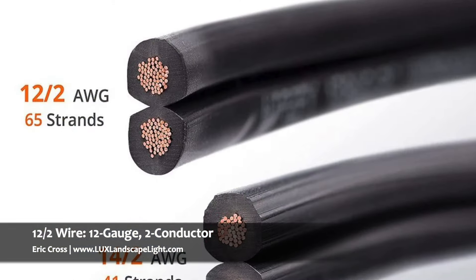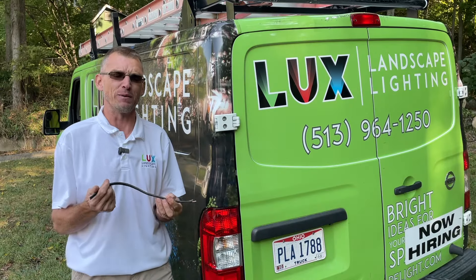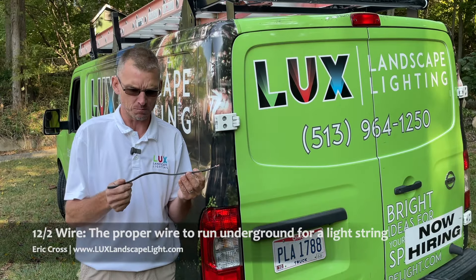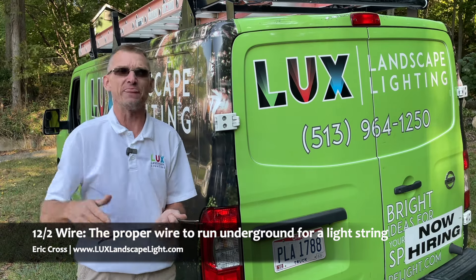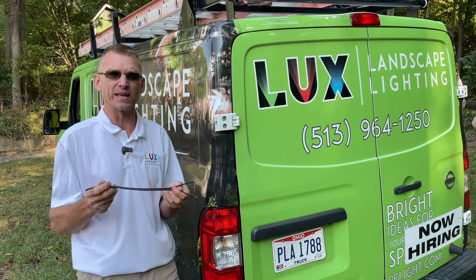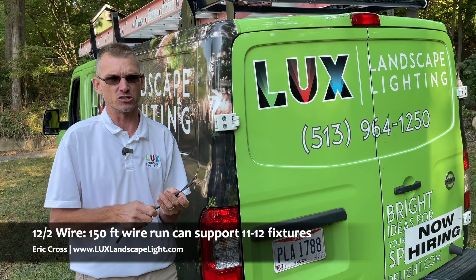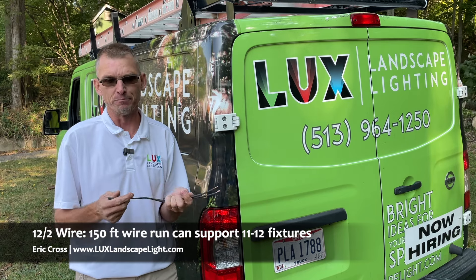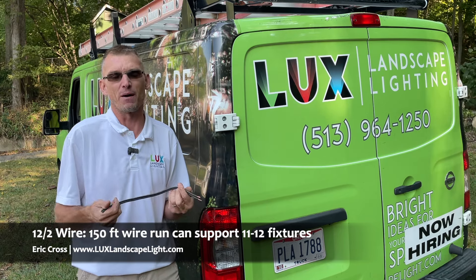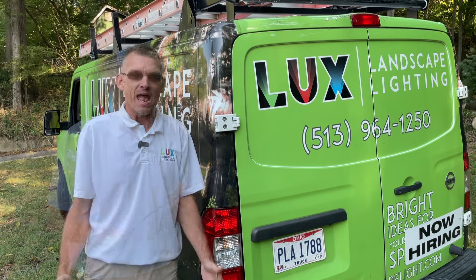You can see it's a lot thicker and it carries enough amperage, but you do have to be careful. You can't get carried away and run it 10,000 feet because it's not going to work. You need to know the calculations and how many fixtures to put on. I like to put in about 11-12 fixtures, and about 150 feet is about the max that I like to use.